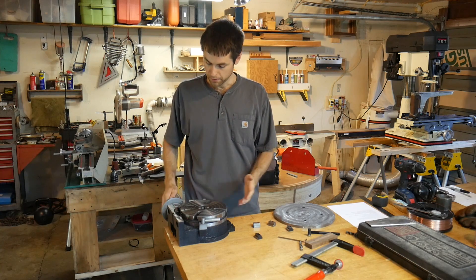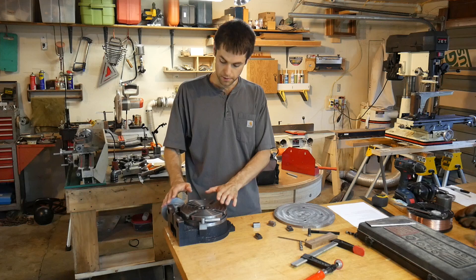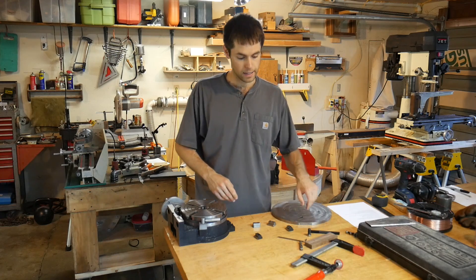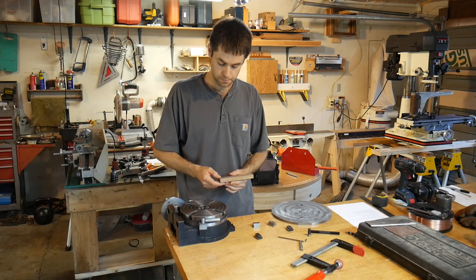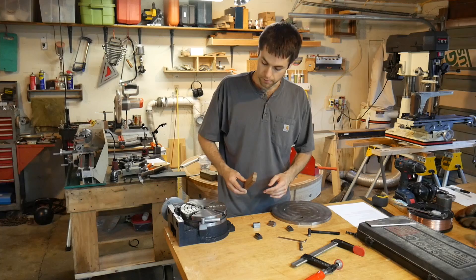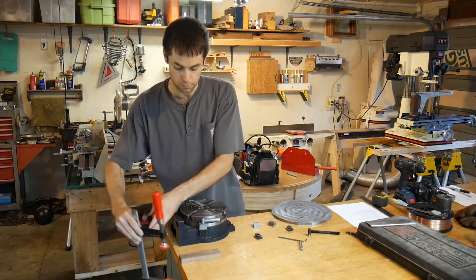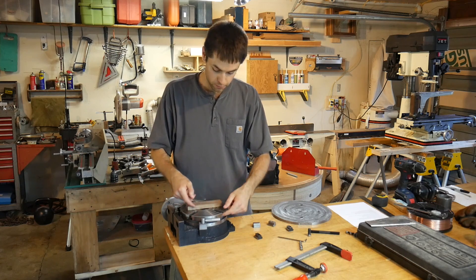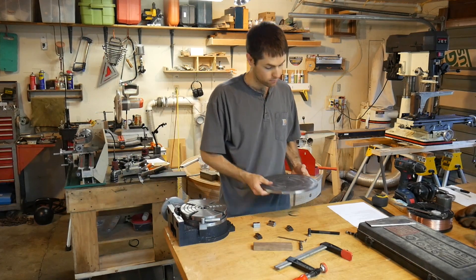This is my rotary table for the mill. You crank this and it rotates — it can be horizontal or vertical. It's a very simple thing, and I thought I would make a simple addition for it: an extender plate. I need to cut some concave radii on pieces, and this being 8 inches in diameter — about what I want for the other diameter as well — the piece would have to be out here, with no way to hold it. With metalworking, you have to clamp up off your work surface and back down onto the piece, so you end up needing more room. An extender plate comes in very handy.